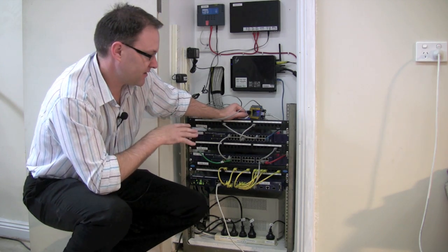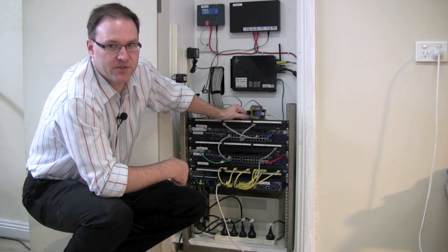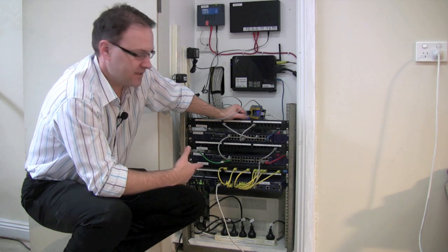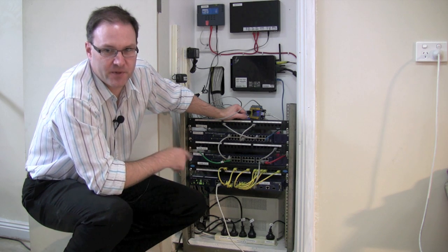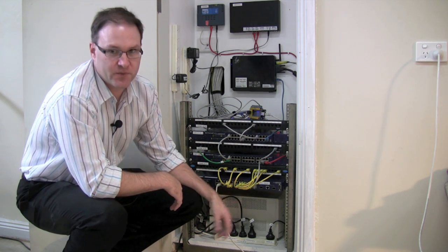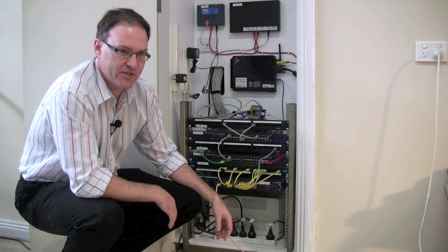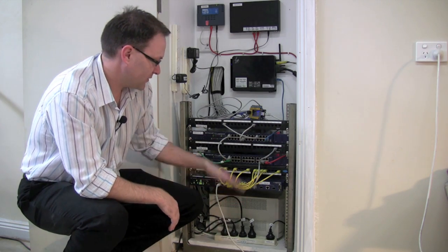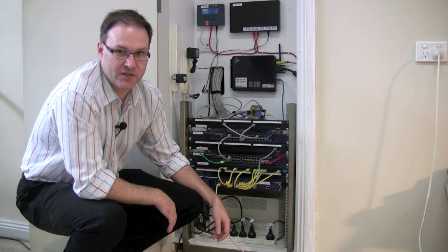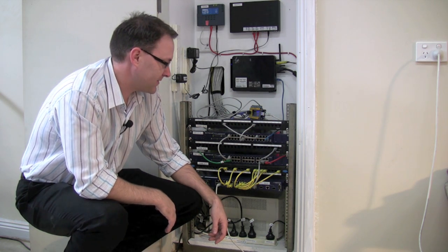One thing to keep in mind: if you slow down the fans on devices, you are deliberately increasing the temperature at which they run. Mean time between failure on electronic components pretty well correlates to operating temperature — make something run colder and it will generally last a lot longer. In this case the temperature hasn't gone up that much. The power over ethernet switch is running at about 10 to 13 degrees above ambient, which is actually pretty good. But keep in mind that apart from fire danger, increasing operating temperature by a bit can decrease operating life. I got all this gear secondhand so I don't care that much if something fails, since it didn't cost me much. I want it to be quiet and a good environment to live in — that's more important to me right now. See you next time.